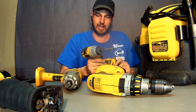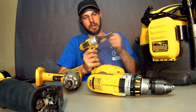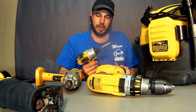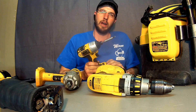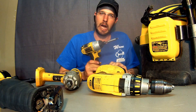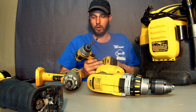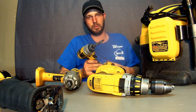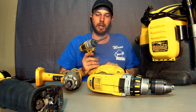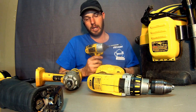The impact driver had no issues with the motor or battery life. What it did have was a shaft in the middle — where it attaches to the outside and connects to the motor — that shaft broke. I was able to take it to a tool repair place; it was within the warranty date from purchase, however DeWalt did not cover it. They said it was just overused and wouldn't be covered. Strike one for DeWalt.